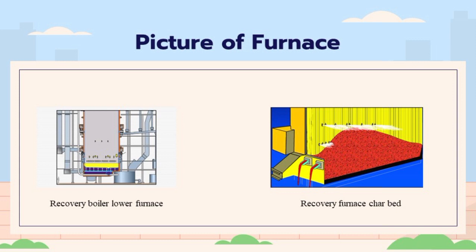Droplet size from the black liquor nozzle must be large enough to land in the char bed, but not too large so it won't land too early without draining properly. Too small a droplet size can be entrained among the flue gases and form carryover in the upper parts of the boiler. Regeneration of the black liquor inorganic chemicals and burning of the organic wood compounds demand different kinds of circumstances.